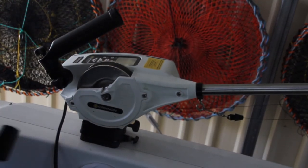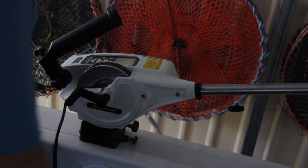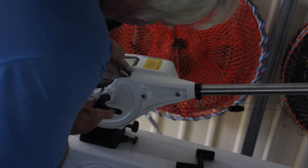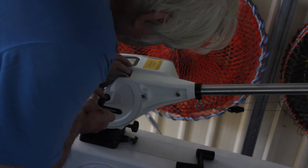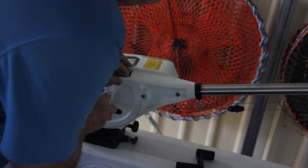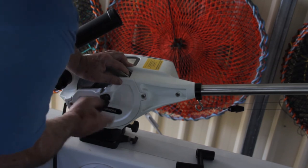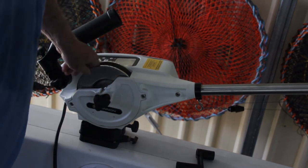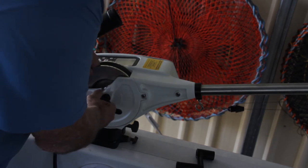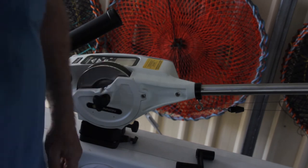Almost forgot — there are a couple of other things to show you. This I imagine is an emergency crank so you can crank it up if the power goes for some reason. And this one — it's a reverse thread, a left-hand thread instead of a right-hand thread; you screw it anti-clockwise to do it up. When you tighten it, that stops the wheel from coming undone. You can loosen it to lower it manually, or I imagine you leave it with the clutch on so the electric motor does the work for you.